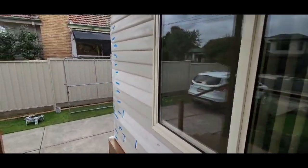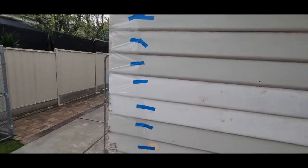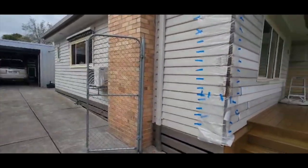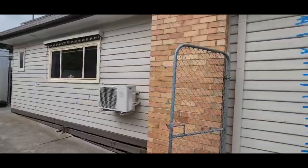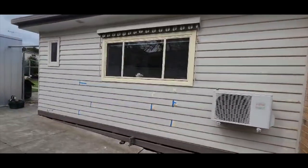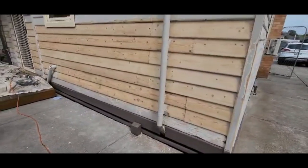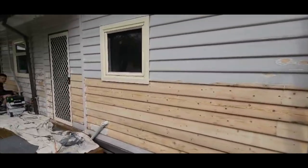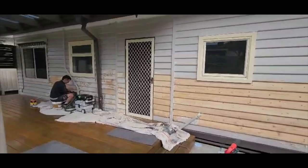Because the deck is in such good condition and we weren't painting the deck, we were concerned that we might damage it if we used Paint Stripper, so instead we used our sanding machines to remove all the paint. There's no real explaining why it happens, but the bubbling was also happening in this area of the house. Quite a substantial amount of paint had to be removed and it's mainly in the areas where the paint is being impacted by the sun, which for some reason is causing the bubbles, and as a result we had to take it back to bare timber.